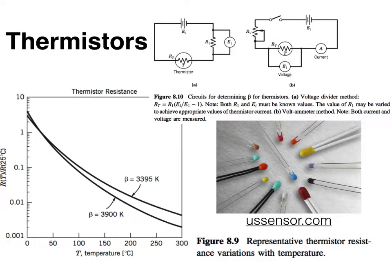If we're looking for something cheaper in a resistance temperature detector, we can go to thermistors. Thermistors are solid-state devices, and they have non-linear variations in their resistance. However, if you put them into a circuit, you can use something as simple as a voltage divider to interpret them and figure out what the temperature is.